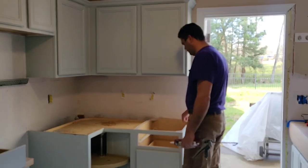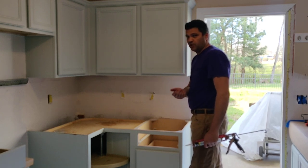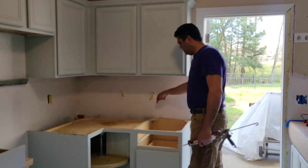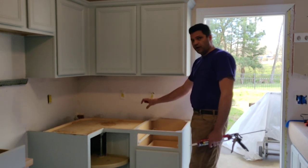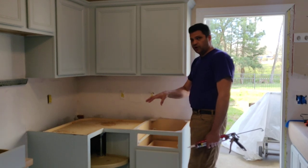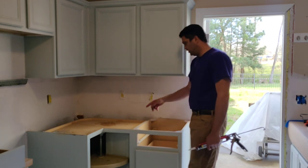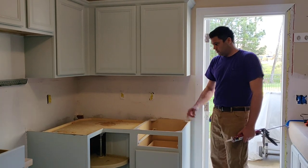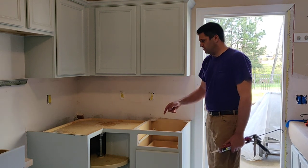We don't want pests to get into this cabinet, and in a previous video I told you about doing the pest block. So I used a whole can of pest block, especially at the mud seal down there where the sheetrock goes to the bottom behind the cabinets. You need to pest block that whole thing around the bottom, because they don't put trim back there. They put trim here on the outside. So a lot of times you'll get mice coming in behind the cabinets when the cabinets are installed.